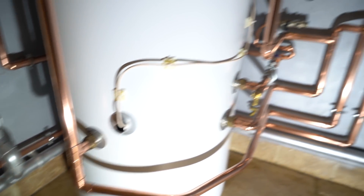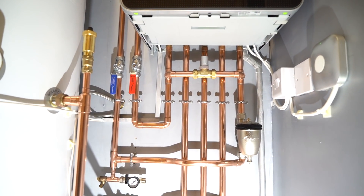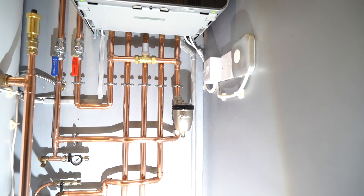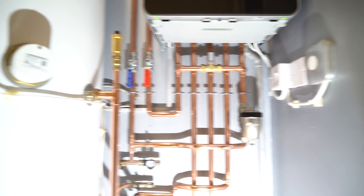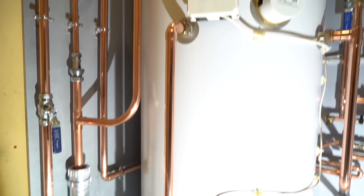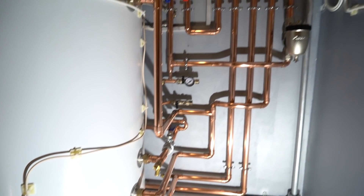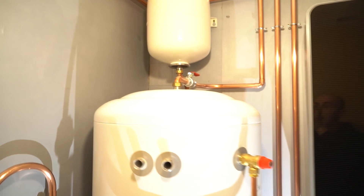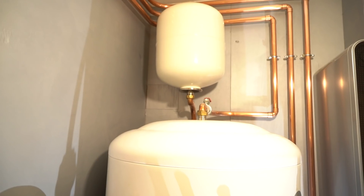Running a thermostat into the cylinder that feeds back to the boiler. It also cuts off if it goes to overheat, which is interrupting the supply. We've got a Nest as well, which is superb - the times are all set up on that. Wiring I've tried to tidy up as much as I can, and managed to get the cold feed to the expansion tucked behind the cylinder. A lot of prep work had to be done beforehand just to get the backboard ready. I kept the old boiler in right till the last minute, which really worked well.